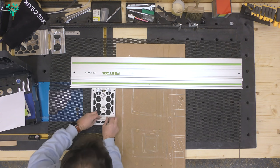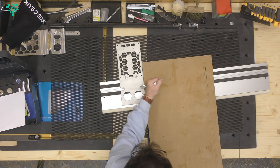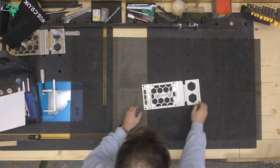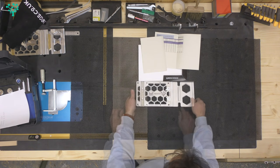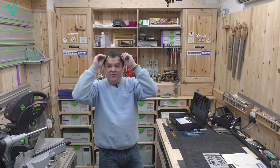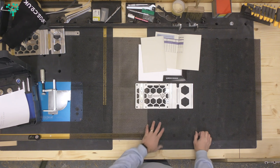The final feature is these cutouts on the plate. They allow for clamping - you can still reference your stock against the edge but now clamp it into position for additional accuracy. So that's the Mark II Rail Square: new tool-less lever locks to lock it into the rail, full factory calibration so you know the device's accuracy, a lovely new finish, and the option to get your logo engraved on the device itself - useful in a workshop for identification if someone borrows it. These four new holes are for upcoming accessories.